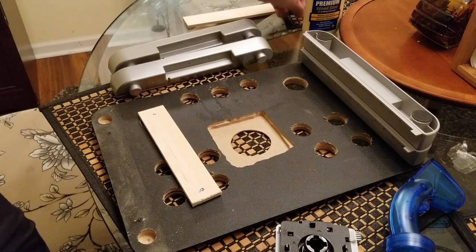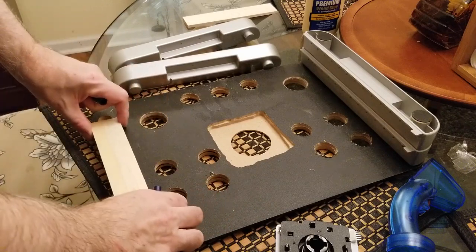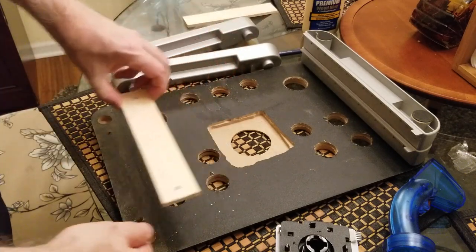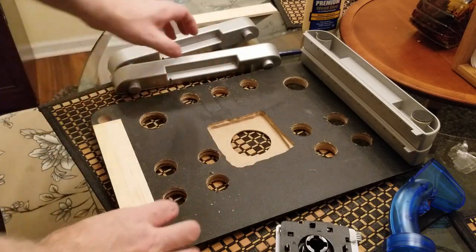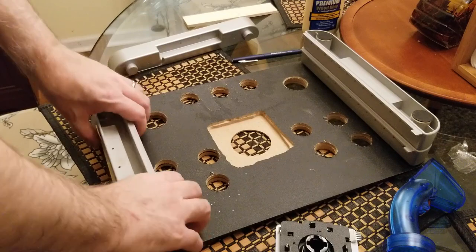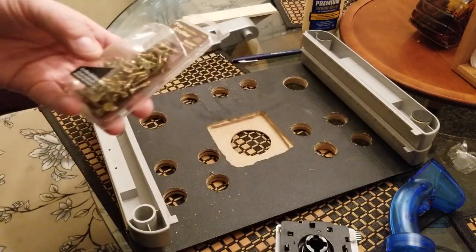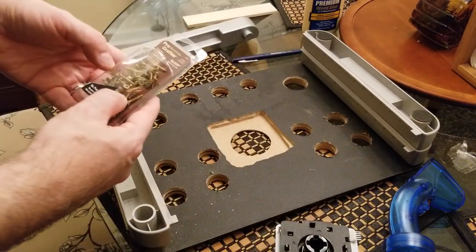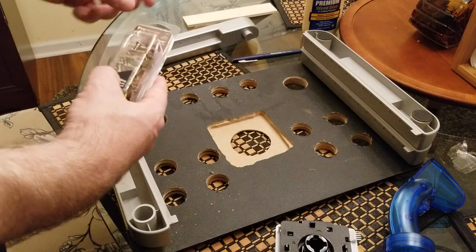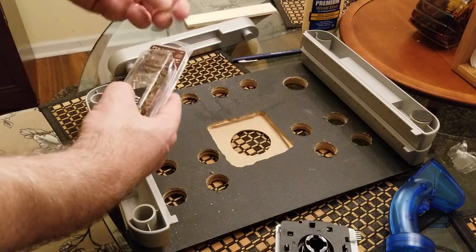Okay, so I took an ink pen and put some ink on each of these holes after I removed this, laid this down, flattened it, and then it showed up with the ink. So I'm now going to drill those holes. Once they're drilled, I'll lay it there, and then on top of that, I will place this, and these have screw holes, and then to that, I will use slightly longer screws. I believe I have the right size here. These are Pro Crafter 6x3/4 inch screws. What came out of here was definitely not 3/4 inch. I would say that's probably more like 3/8 inch. I don't think it's, it might be, it could be a little bit more than a half.